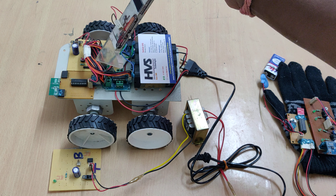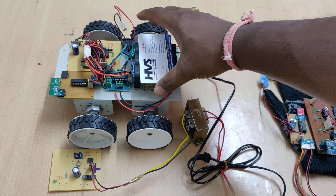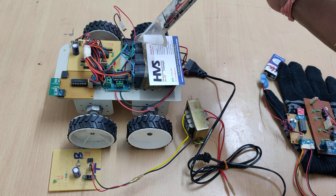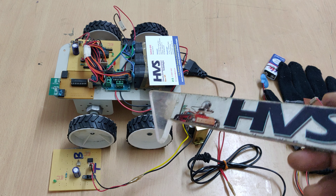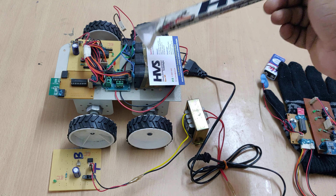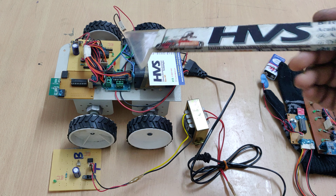At the receiver end, the whole system is powered by a 12-volt, 1-amp battery. This battery pack consists of three 4-volt 1-amp batteries connected in series. When batteries are connected in series, the voltages add up — four plus four plus four equals 12 volts — while the current remains the same at 1 amp. This is a rechargeable battery.